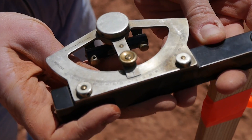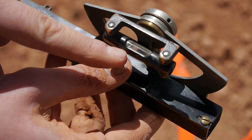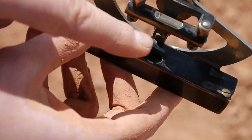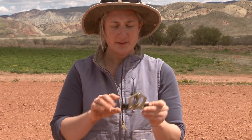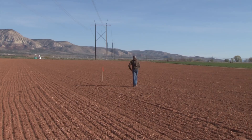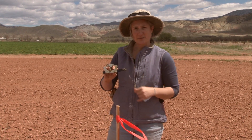The abney level is a little bit of an older instrument. It has a scale that you line up with and it gives you a percent marking. It also has a level bar with a bubble in it. There's a mirror inside the abney level that bounces the orientation of that bubble into the eye hole so you can see it and line up. There's a bar across the front that gives you the level marking, and you look from the eye hole across the slope stakes to the stake at the opposite end of the field, then turn the dial to get the level lined up. You can then look at the dial to get your percent slope.